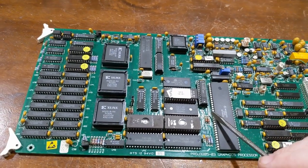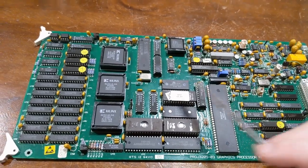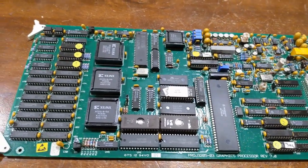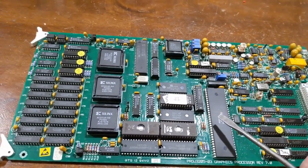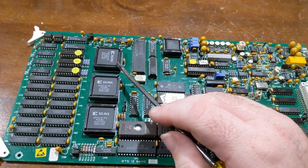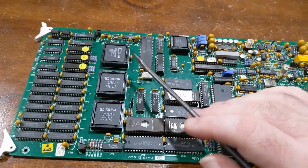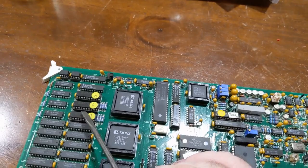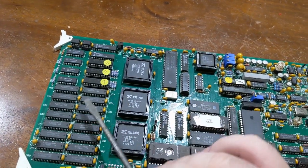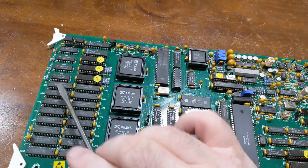So this processor has a DTACK, or data transfer acknowledge, on a bus cycle. And if you want to know the 68K bus cycles, I suggest you Google how all that works. But anyone that knows a 68K knows that we have a DTACK line. This holds the DTACK line when a pixel is being accessed by the 14.318 megahertz pixel clock, the counter timer clock. These PALs here are responsible for switching and muxing this between its banks from these counters.